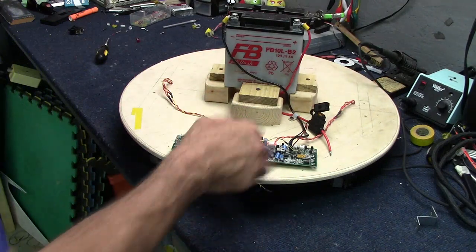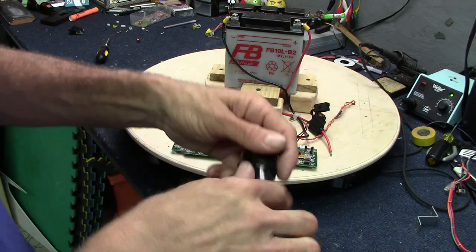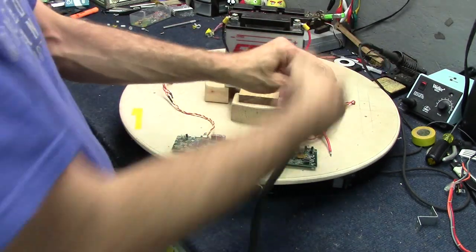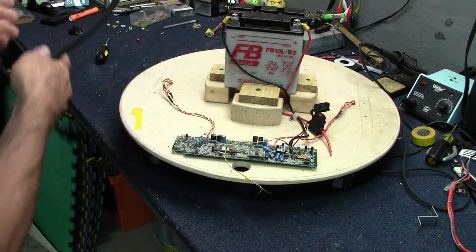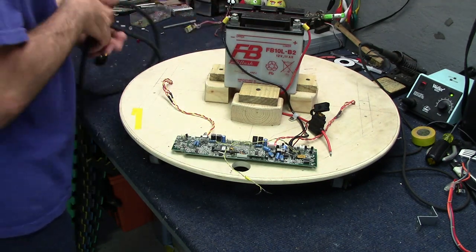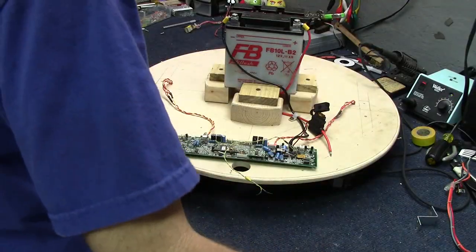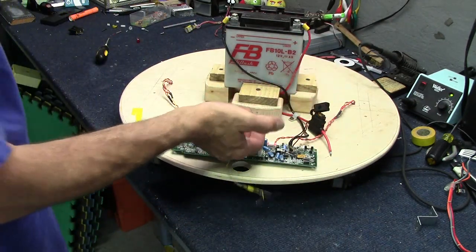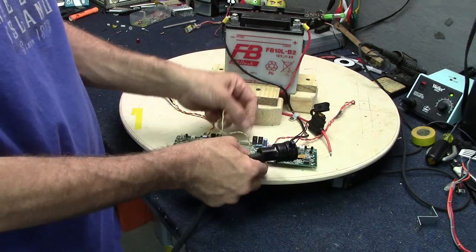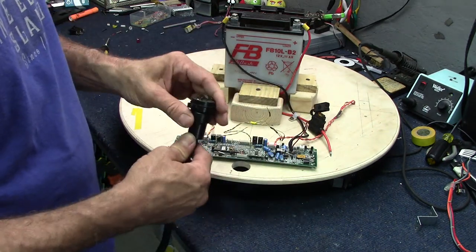I've got a new idea for the design. This is all going to get covered up with a piece of plexiglass, and I'm going to take this old cable that I've got. Came out of the ham radio stuff. I got like 7 connectors to work with on that, and a plug, so I can put a plug on the top and use this to connect it to the head. And up in the head, I'll go ahead and put the microcontroller and any other circuits like the voltage regulator and the ping sensor all up there. So all I need to do is then just run positive negative 12 volts up there, and the 4 leads that come off the H bridges in the old Roomba mainboard. So there's 6 leads, so good enough.